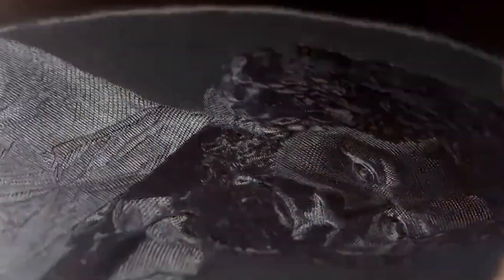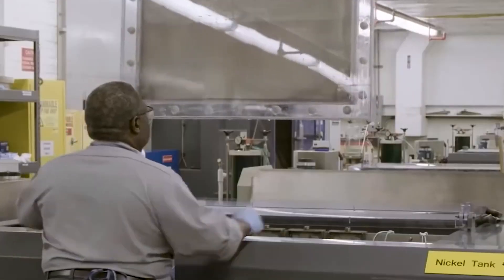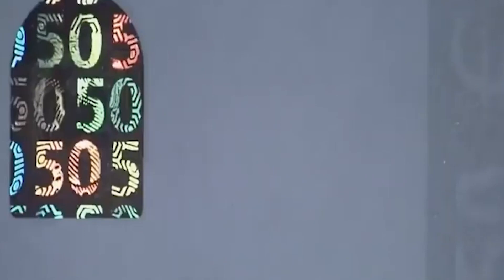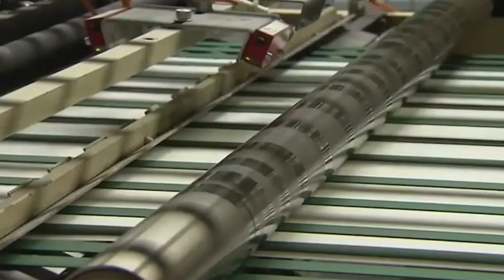The intricate carvings and etchings that we see every day on our paper currency are engraved into a network of fine lines and grooves into steel dies that are transferred and processed to create working printing plates. After careful inspection and minor repair if needed, these plates are cleaned and polished. The working plate is chrome-plated for hardness, and then ready to go on the printing press.